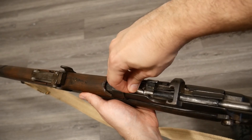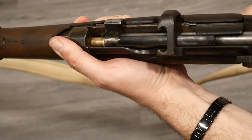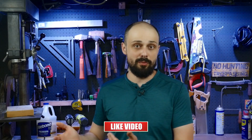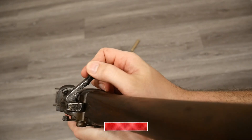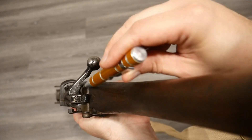To test my rifle's headspace, I inserted the gauge I turned. This was a little tricky since it's not a full-length .303 round. Once seated, I gently closed the bolt — not forcing it, just a controlled movement. I compared this to closing on an empty chamber and then a spent blank round, which acted like a snap cap for me — a control for the experiment that helped me feel the bolt's normal behavior. With the gauge and extractor seated properly and the bolt closed mostly into battery but not all the way, I pushed the bolt handle down gently. The first resistance I hit that wasn't there with the standard case — that's my sign that the gauge is doing its job. If there's space between the bolt handle and the rifle wrist and it feels different than when closing on the snap cap or spent round, you're still in safe territory. That's what you want from a no-go test.